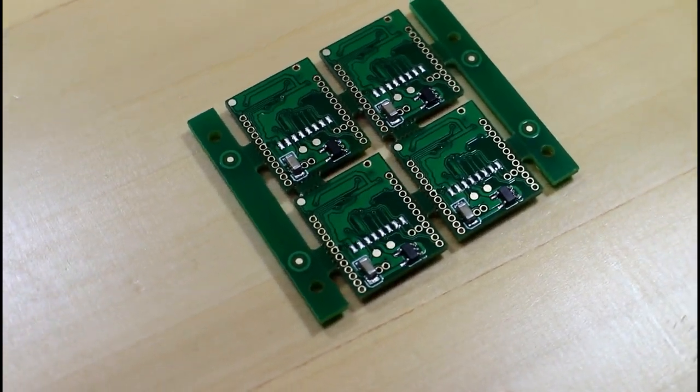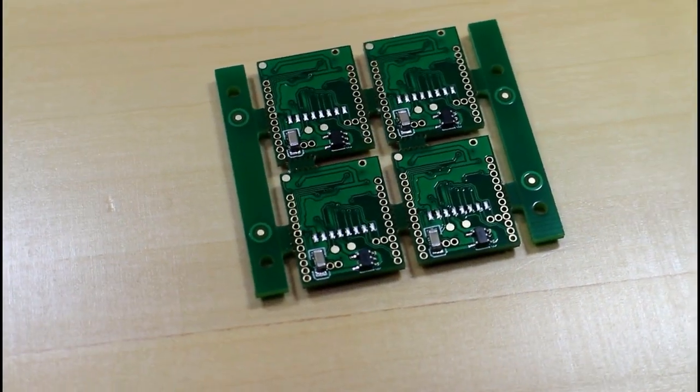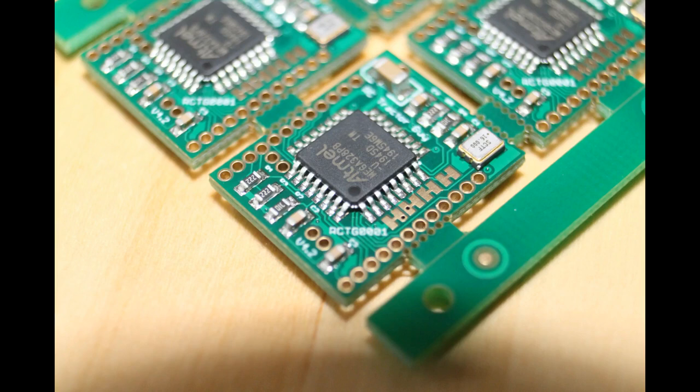We've made a few changes to the boards. The first one is with our oscillator — we went from a crystal-type oscillator to an SMD IC oscillator. That's something different we need to test, to make sure we're getting a signal out of it, because the external crystal functionality had been removed from the ATmega 328PB chip.